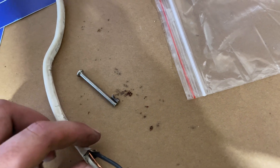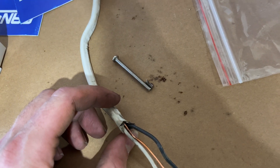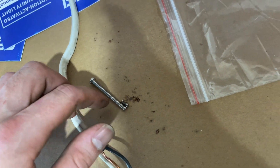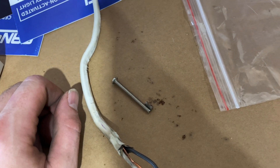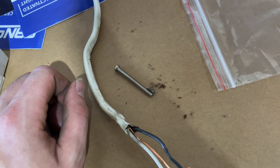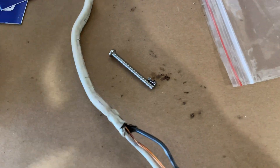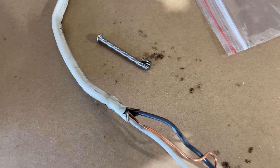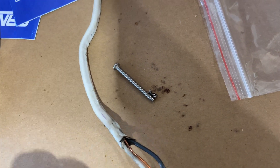So that's just a quick PSA update on what I'm doing. Just be careful, double-check stuff as you're wiring it, and think about these things. I didn't put together that spatial relationship between the bracket and the wires coming in. What I should have done is have the wires come in at an offset on that pancake holder — the knockouts are available and I should have used them. Even when you're putting in boxes, if you know what kind of fixture you're going to install, mock them up on the bench first and look at where the wires are going in and out, and look for any pain points so you can avoid stuff like this. Thanks for watching, we'll talk to you next time.